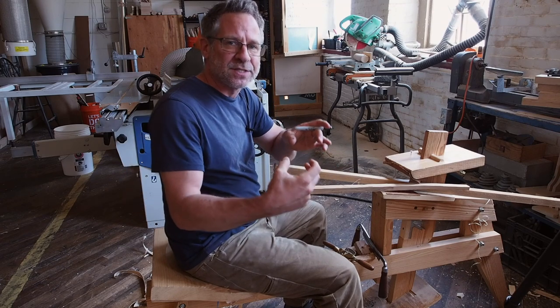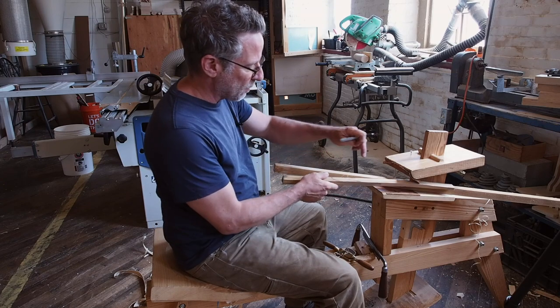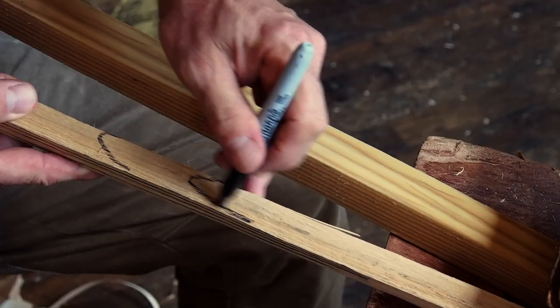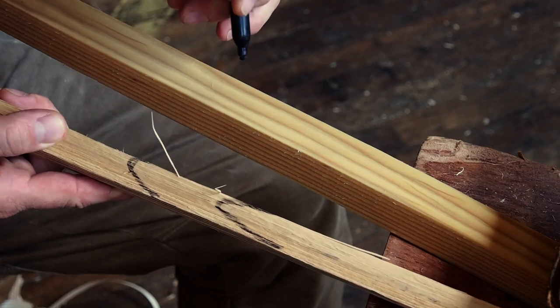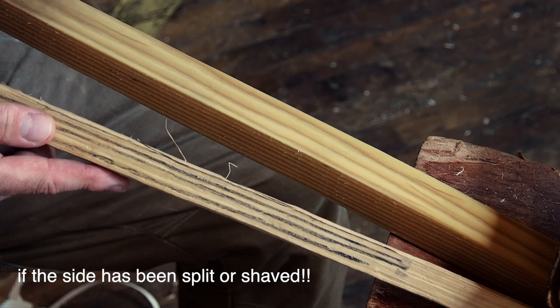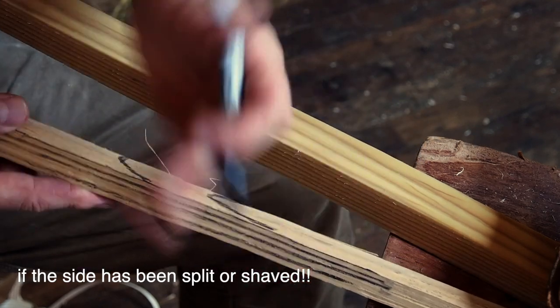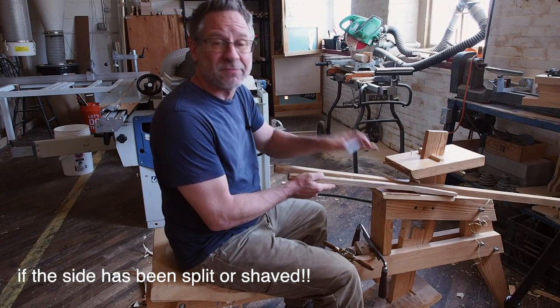All the information is included on the side of it. And that's the critical thing to think about here. So if I want to know about this, I can see some of the information here by seeing if there's any growth rings that cut across. But really, it's the side with all the info. So if indeed this surface is parallel to those edges, I know I'm following it, just like a piece of paper would be on the top of a stack.